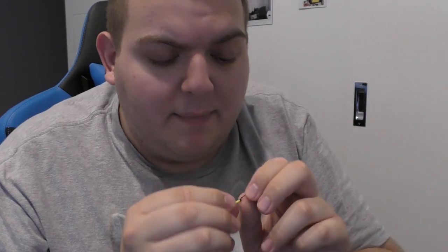I believe what happened was when I went to take the black filament out, a little bit stayed in the printer and was actually still printing around with a little bit of filament in there somehow. And then when I tried putting the yellow in, it wasn't going in because there was that little bit of black filament left. So long story short, I ended up getting it in finally, though I did miss a little bit of the layers in the crest, which I can show you in a second here.